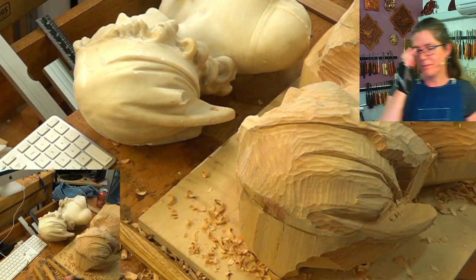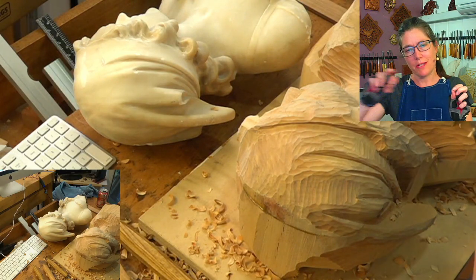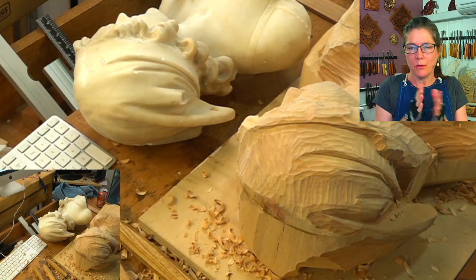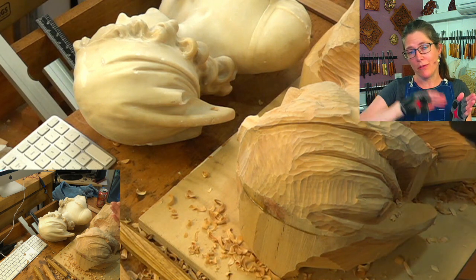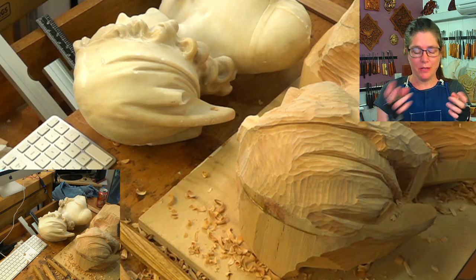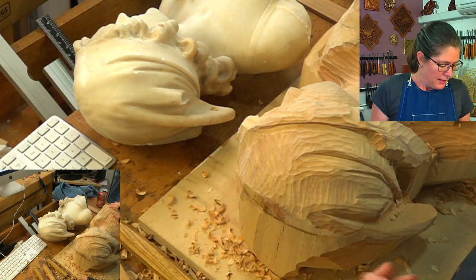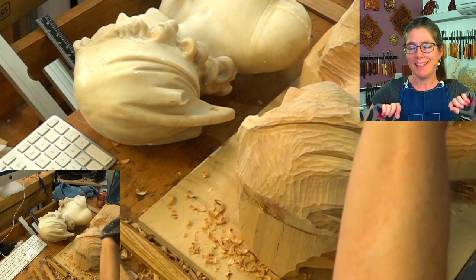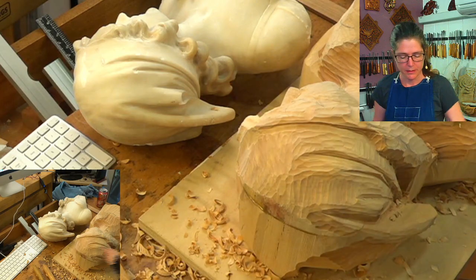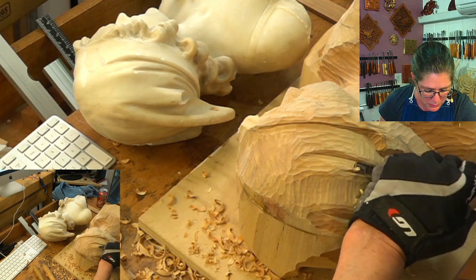What happens is it gets kind of spongy. If you ever have black streaks across basswood, usually if you hit that area, it's either a rotten part of the wood that'll just turn into sponge, or it actually does the reverse sometimes. It gets very hard. So it really depends on what's causing it, whether it is an actual fungus or rot. But usually if there's some sort of discoloration like a streak, it's going to end up affecting the quality of the carving wood, and it's kind of unpredictable at that point.